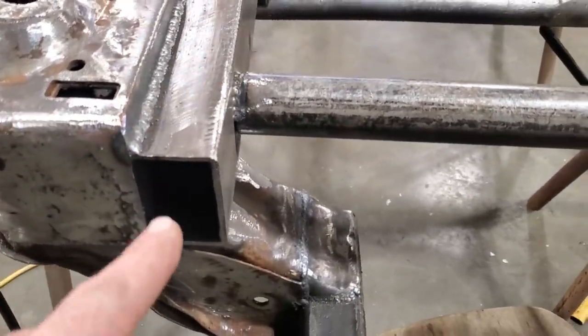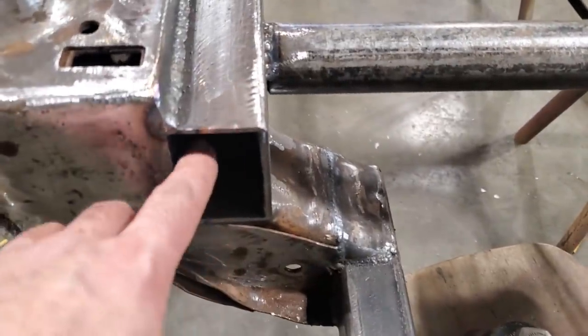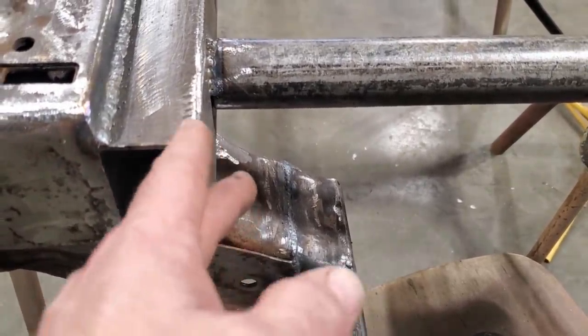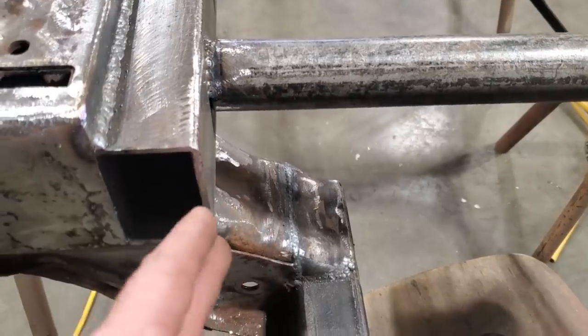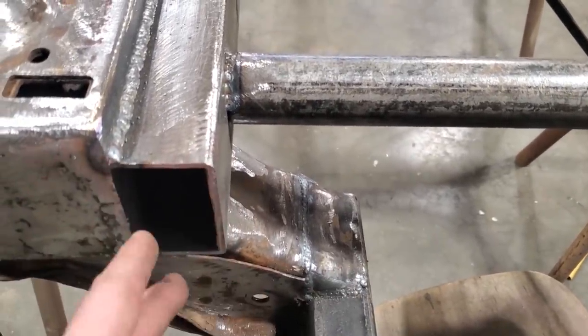So now I got two of them capped in, and that job is finished. I finished everything off. Now next thing I do is I got to cap these ends. So what I'm going to do now is build a piece that just fits inside here, because I want it to rest on this here, and I don't want it to overlap. I want to have it so that there's like a V in the middle there between the two panels, and I can weld that on.